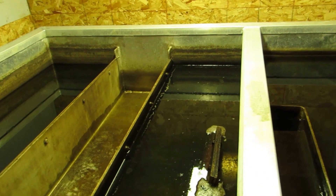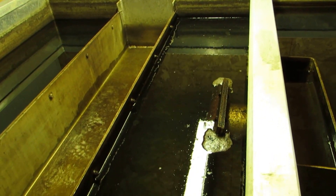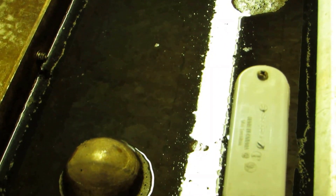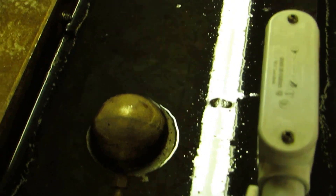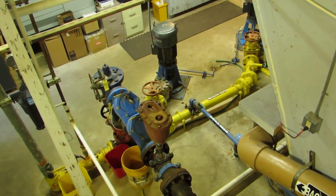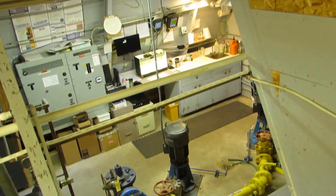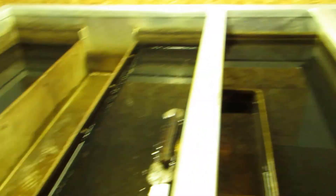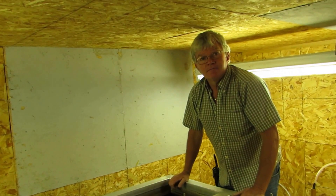At some point the filter gets dirty. The center section is a trough — that trough in the middle is designed to carry the wastewater out of the plant. We backwash the plant by reversing the process: we shut the incoming water off and use finished water from our system to back-flush up through the filter. The dirt and sediment rise over into this trough, which carries it down to a sewer manhole at the end of the building and then out to the sewer system, ending up at our sewer plant.